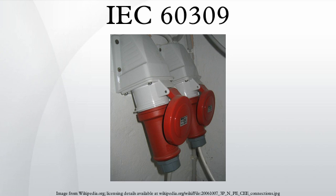The fittings also include limited weatherproofing; that is one reason for choosing these fittings when the connections will be used in open air conditions. A further reason for using these is to deter potential users from connecting domestic appliances to the sockets, as normal domestic plug tops will not fit.